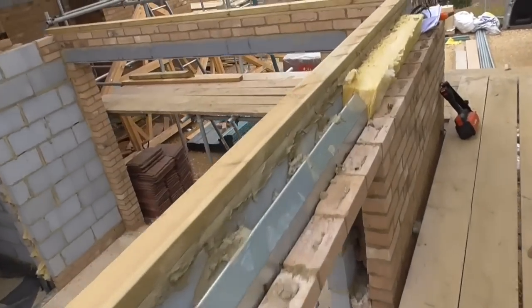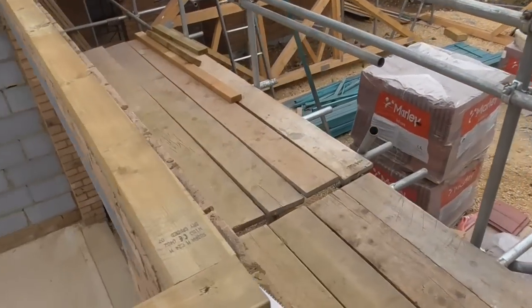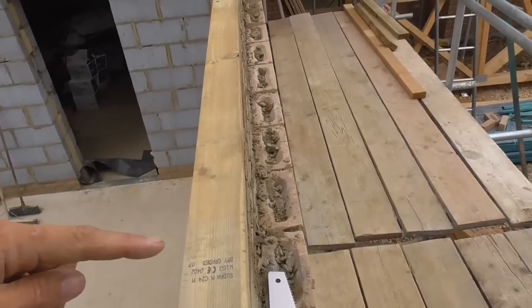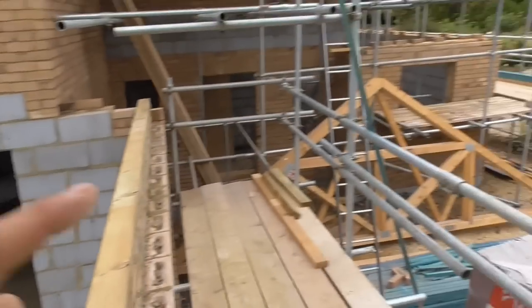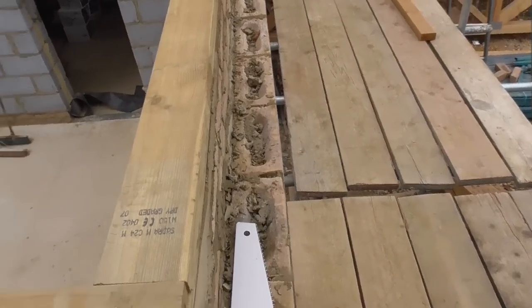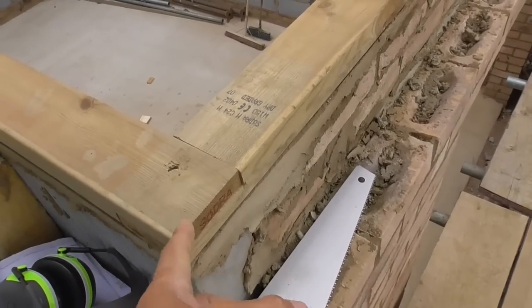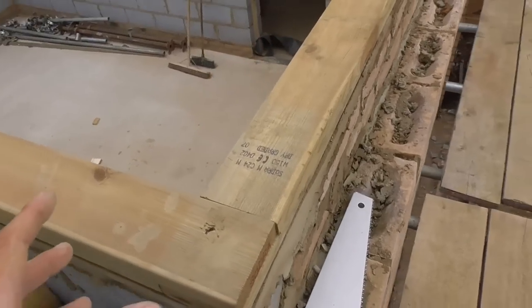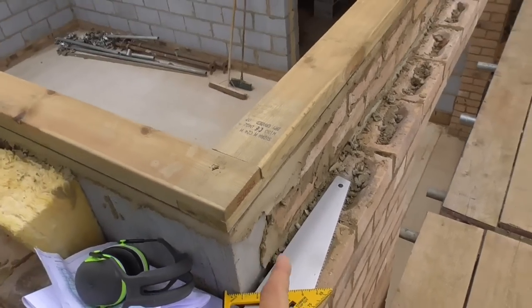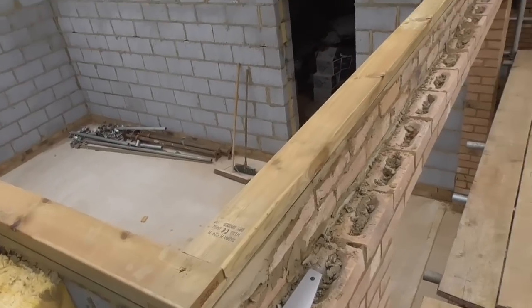On the front, because of the lintel, it's only 200mm so there's no cavity. So basically the trusses in this instance hang over an extra 100mm here, which basically means the hip won't strike the corner here. It strikes 100mm further out. But it can catch you out, and I'll explain a little bit as we go.